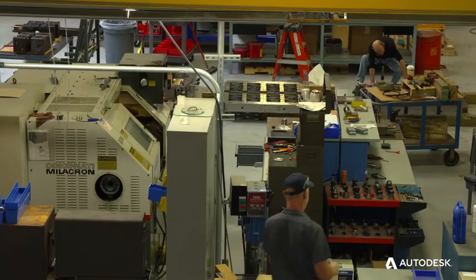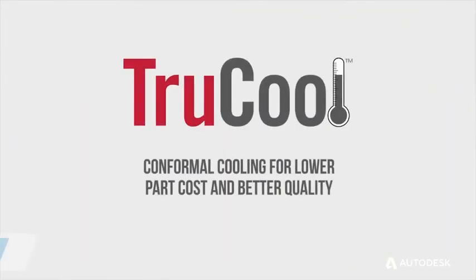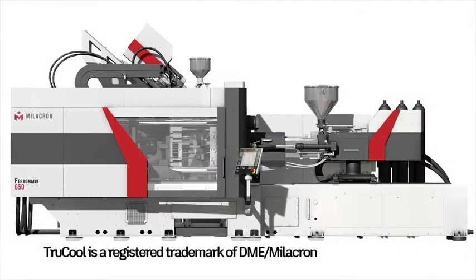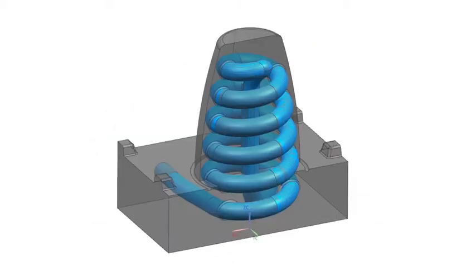Most companies are out to reduce their cycle times and the cost of manufacturing these components, all at the same time trying to produce a better product than their competitor. The strategy that DME has applied to this concept is adding TrueCool to our line of products, which is thermal control of plastic injection molds. And we do that through additively manufacturing conformal cooling cores and cavity inserts, lifters, slides, whatever the case may be.